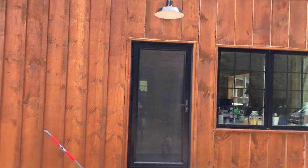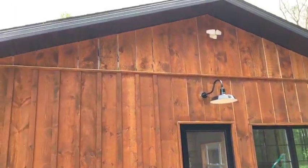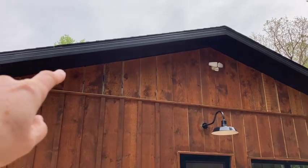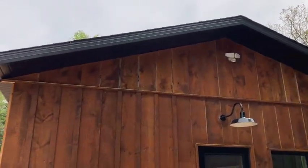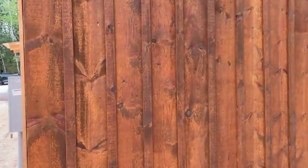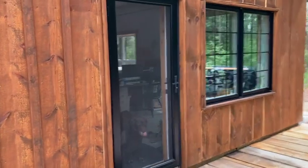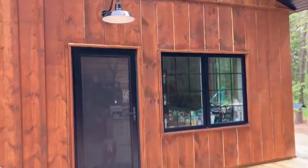It's Saturday, May 21 — the day after my wife and I celebrated our 27th anniversary. She's stuck with me that long, hopefully she continues — I think she will, she's pretty awesome. So I'm working on the house today. Finally a nice enough day and I don't have to guide, so I'm working on staining the upper half. I have to add trim to the top peak, then start doing the battens up there. I've already started the battens here and have to continue to the other side. Before that, I have to add trim around the doorway and the window — that's got to go on first before I can continue the battens.